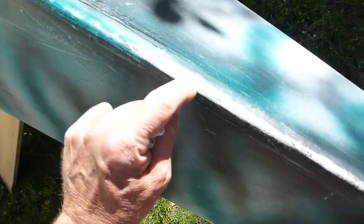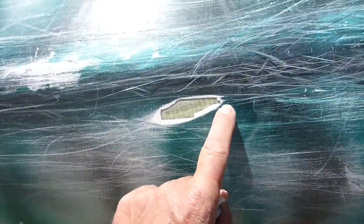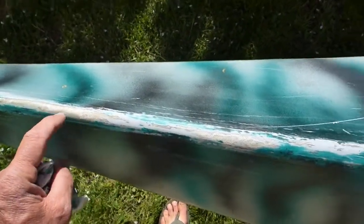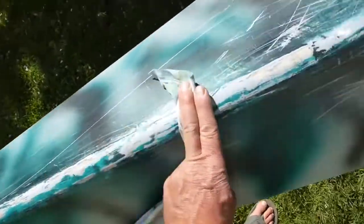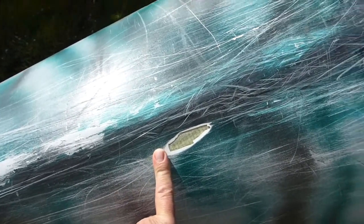I patched the inside and it works pretty well. Flipping it over, I noticed I've got a lot of wear down through the keel and some big chunks out of the gel coat all the way down to the fiberglass. So I sanded that back — that's what the little white edge is around there and down on the keel as well. I roughed it up and washed it down with some acetone on a rag, and I'm going to fill it with that same mixture of resin and fumed silica.